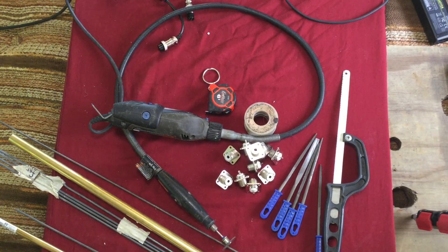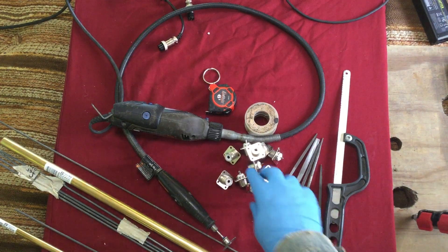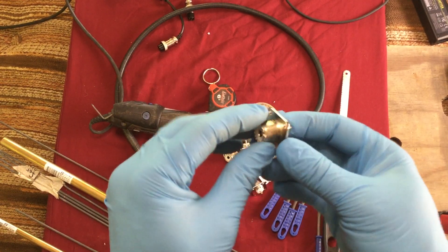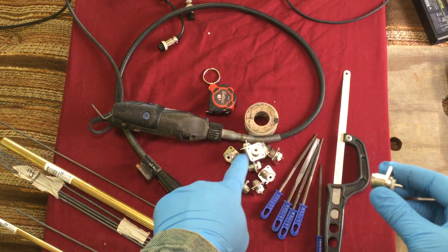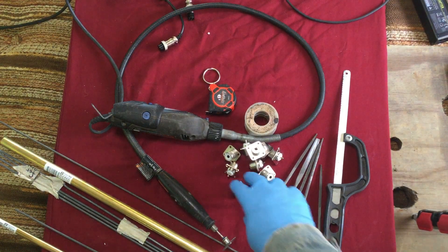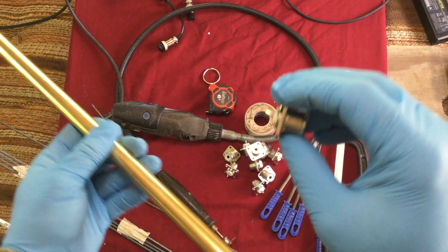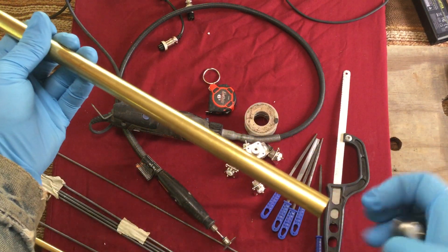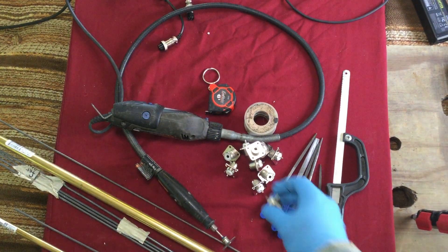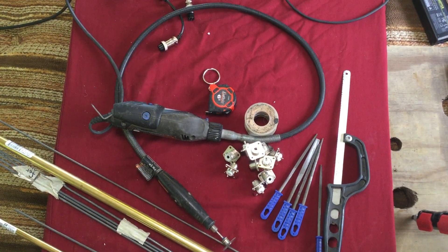You can usually buy these materials, though the brass tubing can be a little pricey. You're also going to need — I almost forgot to mention — SO-239 chassis mount connectors. I bought a whole bunch of them on eBay for like $10 or something, really cheap. We're going to use these for the coax hookup, and then I'll take my tubing, solder a copper wire off of it, and hook it to here. I'll figure it out as I go, but we'll mount them like that. You're also going to need those. That's how I want to make them so I can adjust the antenna — I don't want to have to cut the antenna to tune it.